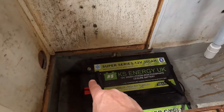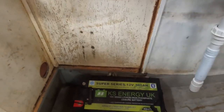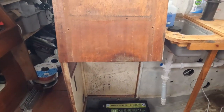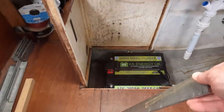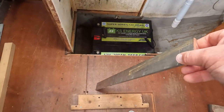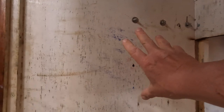There will also be a fuse on the positive — the last positive in each series of four batteries. So it's four 12 volt batteries in parallel with another four 12 volt batteries. This is the tinned copper busbar material that I'll be making the two busbars from. On the other side of that bulkhead — you can see the mounting bolts here — is the multi-plus.